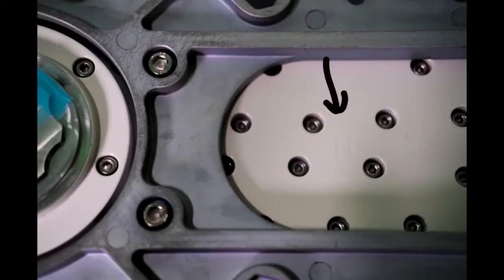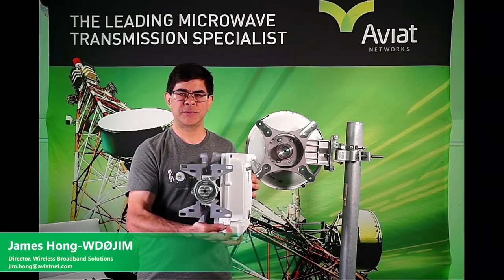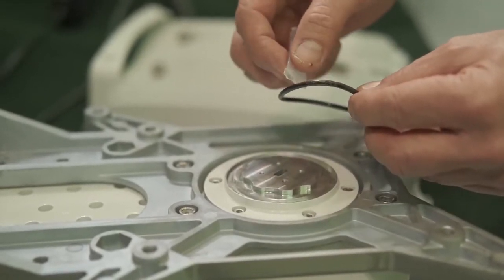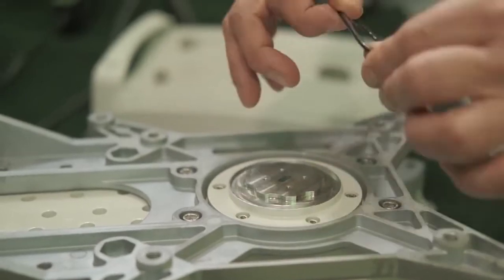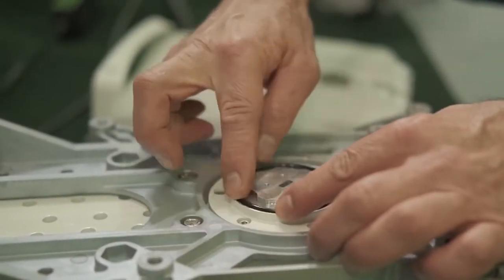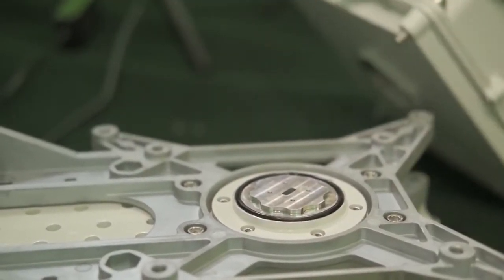The next step is to mount our radios onto either side. Here's the V for the vertical side, and here is the H stamped into the metal for horizontal. I've mounted one radio onto our dual mount adapter — next I'll show you how to mount the second radio. Take the o-ring which came with the OMT adapter and a little bit of silicone grease. Put it on the o-ring, make sure it's evenly coated all the way around, then put this o-ring into the slot right around here and make sure it's firmly seated. Then take the radio and mount it on top.